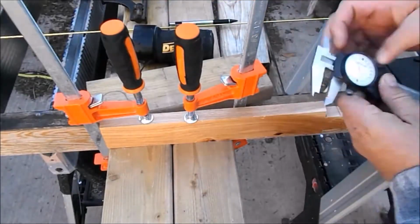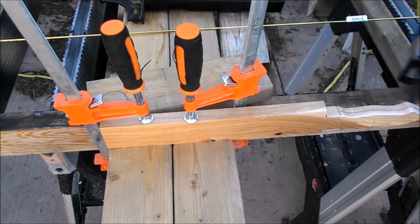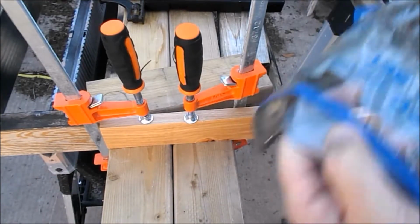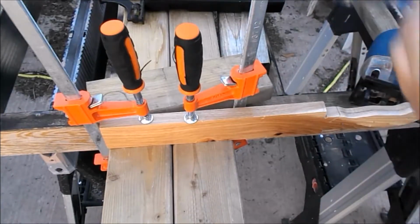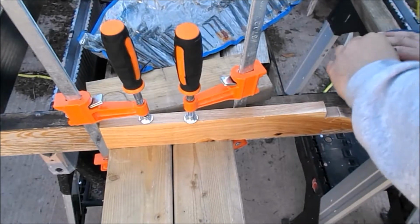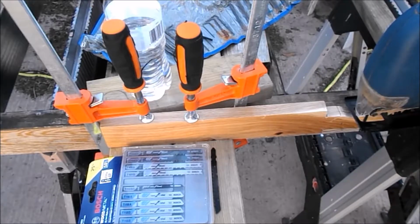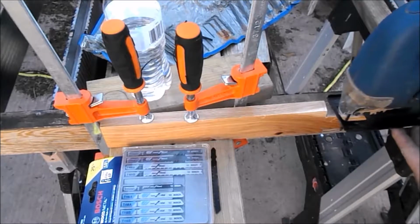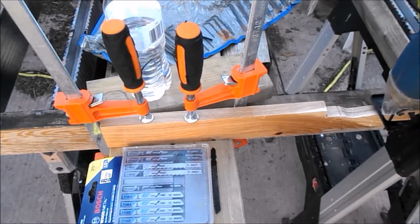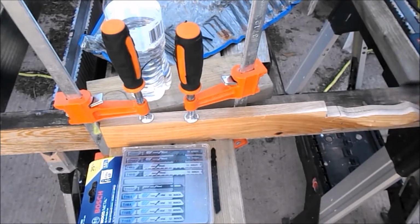Turn it over here. Last night, when I put the hex key away that does the jigsaw, I looked. It's a 3mm. I'm going to try to use it real slow. Got to get the blades though. I'm just checking, and I believe the blade will go all the way through. It'll stop there, which is where the blade curves. I'll probably have to finish that off with the coping saw, but I may end up having to do most of it with the coping saw, but I'm going to try it with the jigsaw first.